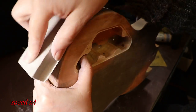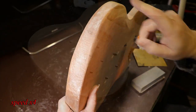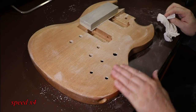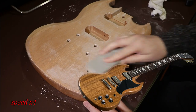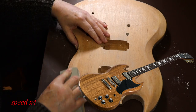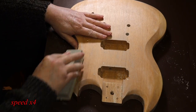You might be thinking, what's the point of them sealing the guitar if I'm going to strip it off again? Well, there's a good reason for this. If you were to be painting the guitar a solid colour, then it really wouldn't matter. You can paint an undercoat on and then you sand that back down and you get a flat surface using undercoat. However, I want to create a vintage violin look where it looks like old wood and a sort of dark varnish. Because of this, you'll be able to see the wood coming through the varnish and therefore you'll be able to see the tooling marks. So I need to be able to remove as much of those tooling marks as I can, so at least it's not as obvious.